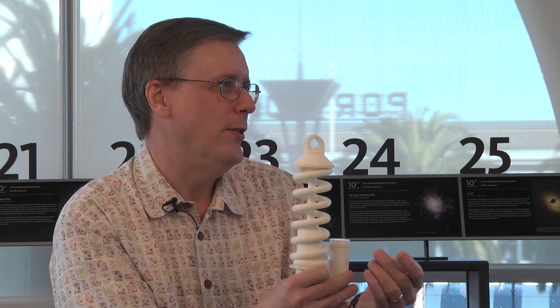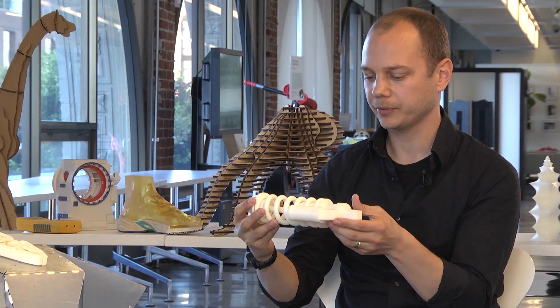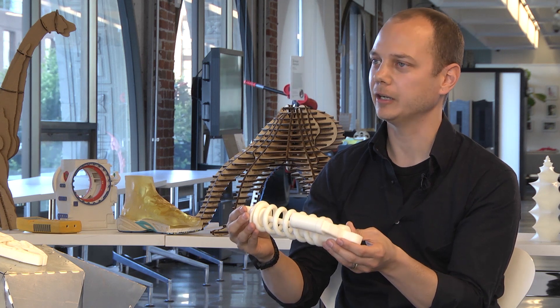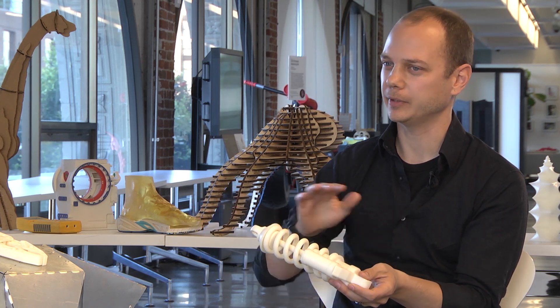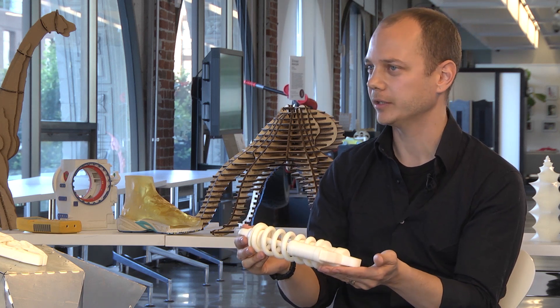What's the sort of design process? I've made my shock absorber and designed it in my 3D program — now what do I do? Do I hit a button and send this to a printer? So most 3D prints work off STL files or OBJ files, and almost any 3D software program can export to STL or OBJ.